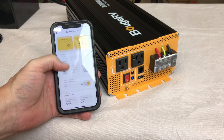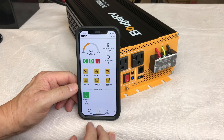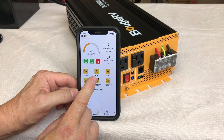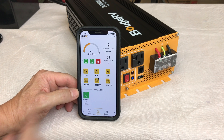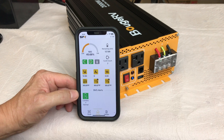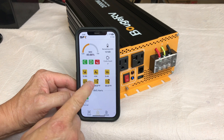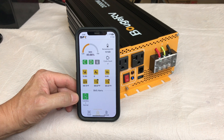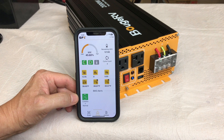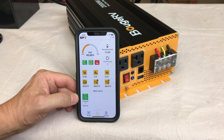The SFK battery app is showing amperage at about minus 0.5 amps, cycling to zero repeatedly — the inverter must be searching for a load. When searching, it draws about 0.4 to 0.6 amps, which is roughly 6.6 watts. Standby consumption is pretty minimal with this inverter, and that's a plus.